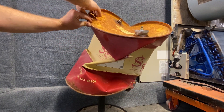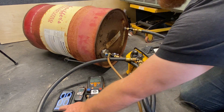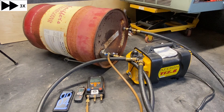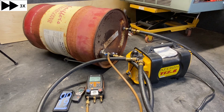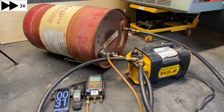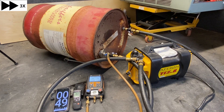Now let's reset this whole system up so we can take another look at it. For this setup we use large hoses. We did away with the manifold gauge set, we did away with the valve cores, we did away with the automatic low-loss fittings, and we use much larger half-inch hoses. Now we're pulling from both sides — half-inch hoses, no valve core, no automatic low-loss fitting restrictions — straight to that vacuum pump.